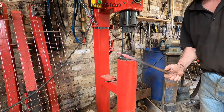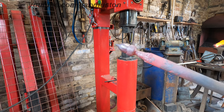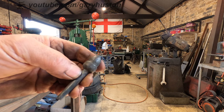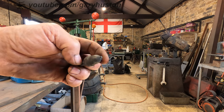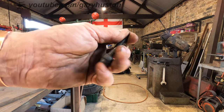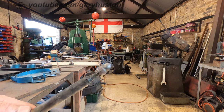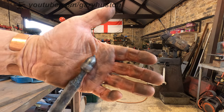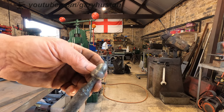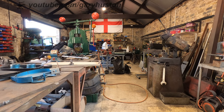Not bad at all for a first attempt — I'm pleased with that. It needs a bit of refining on the actual tool, the die. But to all intents and purposes, we've got ourselves an acorn. The first one I did, I just drew out the stalk. It needs a little bit of refining — there's a few tiny little marks. At the end of the day, if that's on a job, galvanised or powder coated up on a fence or a railing somewhere, you're never even going to notice. But I would like to get it a bit better. You can see around the neck it makes a bit of a mess. So I'm going to try and refine the die so it doesn't leave all this mess. That's the second one I've ever done out of that die, and that's pucker.